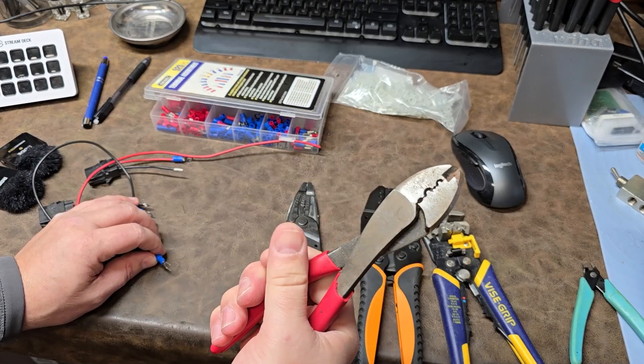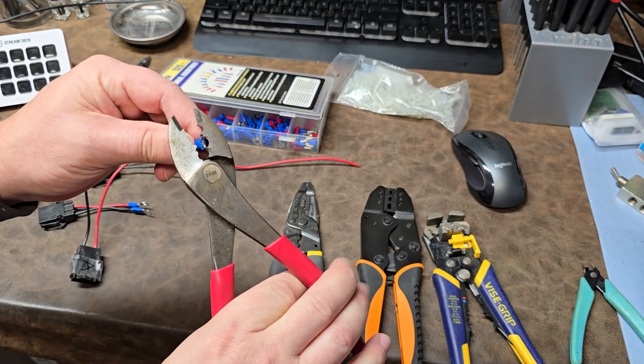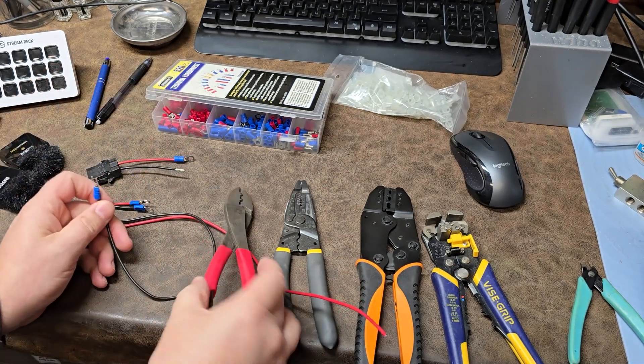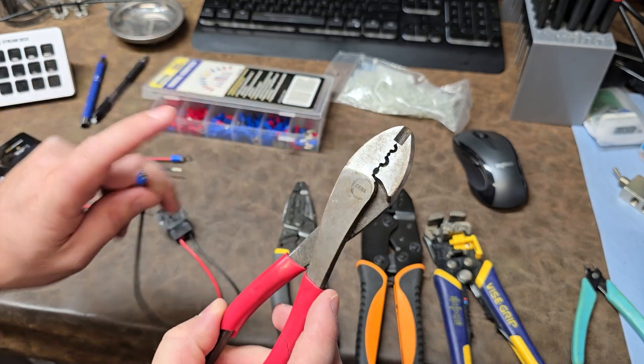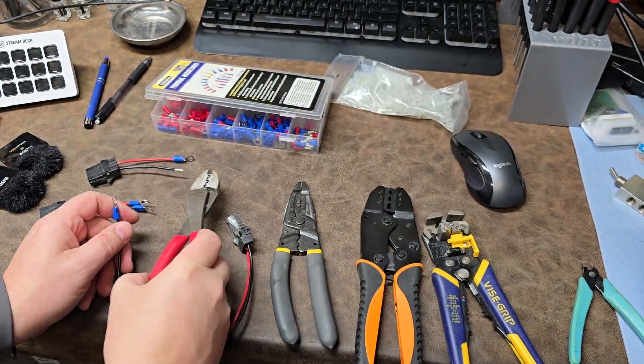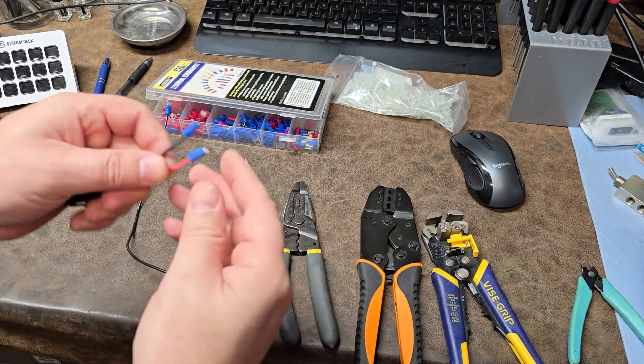They're a little bit heavier and they don't have a wire strip option, so if you're a field technician I completely understand it — I've done it myself for years. These pliers are just a standard because you can do more than one thing with them and they don't take up too much weight in your bag. If you're an electrician, the style right here is the one that can really squish the fibers off to the sides and you'll get bad crimps. So if you're going to use them, use them correctly — orient the little bump on the opposite side of the slit in your connector and you'll get a fantastic crimp every single time.